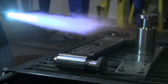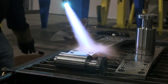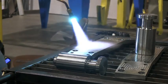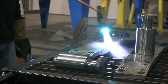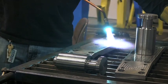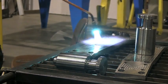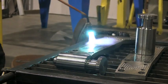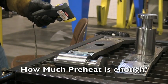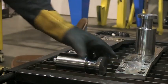This is a low alloy high strength steel that will harden if it heats up beyond a transition temperature and then cools too quickly. The thing we want to do with the preheat is slow the cooling rate. I'm also heating it up here just for fit-up purposes because it's a pinch fit — that pin will not even fit in the hole until I get this thing expanded beyond a certain temperature. I'm using a little IR gun there to check my preheat.